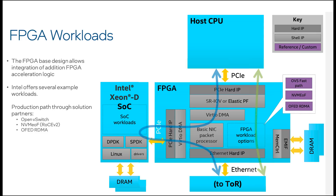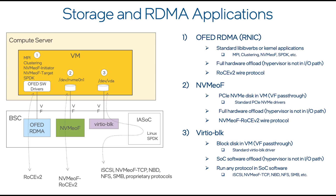The FPGA has its own memory, and it's able to do things that are not necessarily what you'd be able to do with an ASIC or a normal CPU. Specifically, you can create a fast data path that goes from the network interfaces all the way through the FPGA — you can do anything you really want in that data path: compression, encryption, anything like that. And then you can present the devices you want to the host system using the PCIe bus.